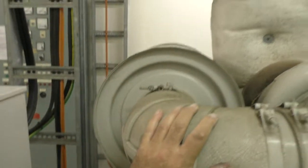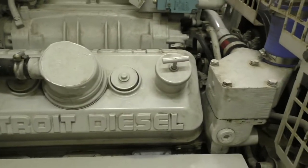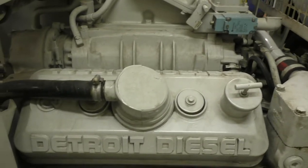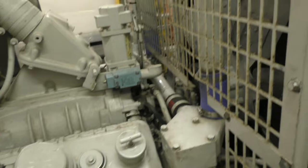There's the exhaust. My hand for size goes up there and out there. It's quite clever the way they've designed this because it's a 440kVA generator with something like a 300kW engine, so that if they get any shorts on the alternator it won't burn the alternator out — it will just stall the engine. I thought that was really quite clever.